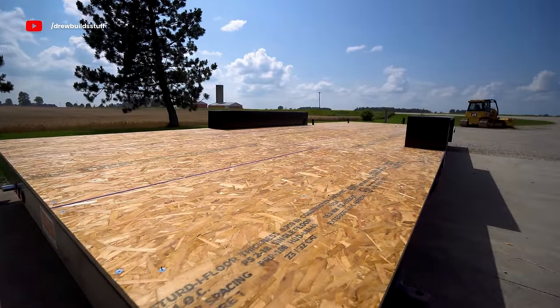So for this siding company specifically, I had to measure out 3 inches on both sides of the corner at the top and bottom of the wall. Then I just tacked a nail on one of these ticks up at the top and used my chalk line to pull that down and line it up with the line at the bottom and just snap myself a nice straight line.